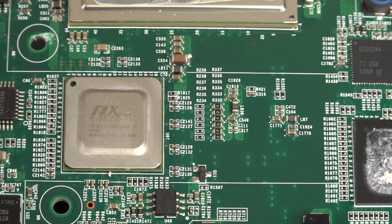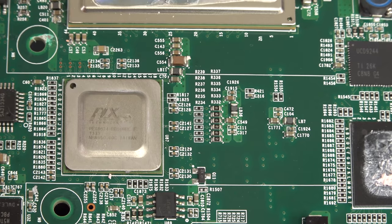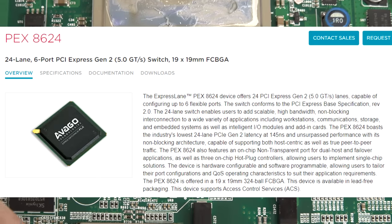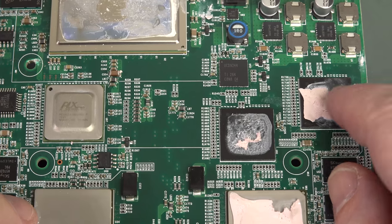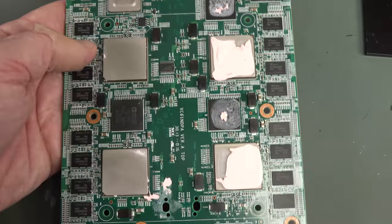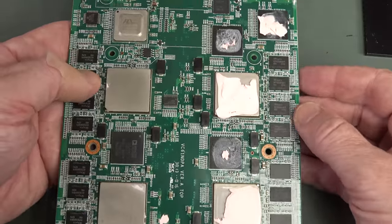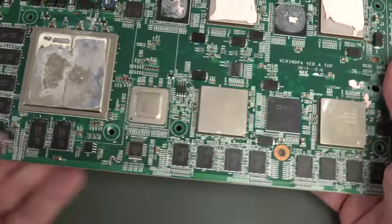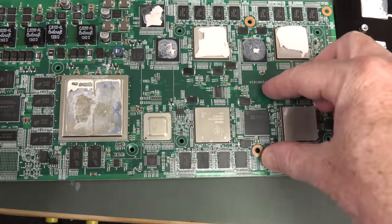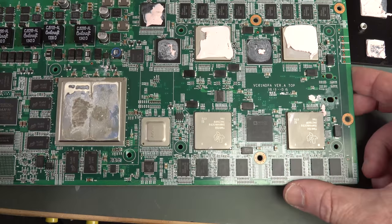Why is this one different? Well, it turns out that's actually a now Broadcom-owned PCI switch, like a 6-port PCI switch. So there you go, they're still doing PCI stuff at that point in the system. Is that another Analog Devices under there? The layout's a bit odd, because this one's probably associated with this one, and this one with this one, something like that. That could just be a layout thing. You would have laid this out as a block first and then duplicated it like this and then figured out how to fit this in. So it seems a bit oddball, but anyway.